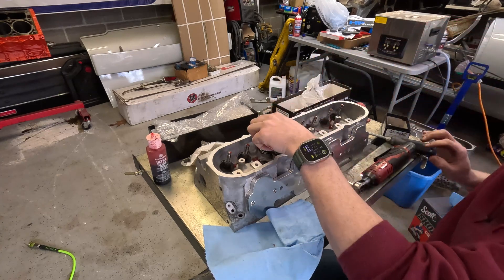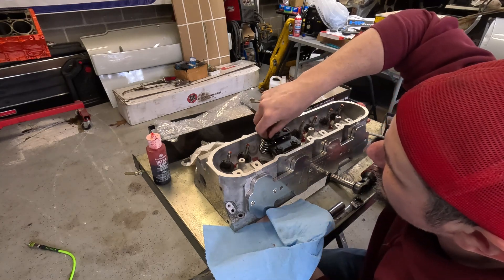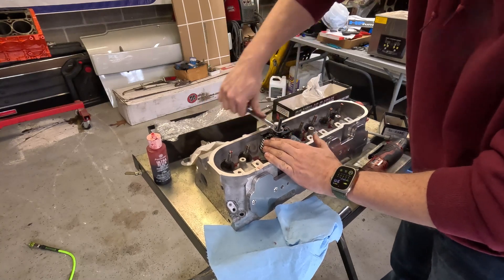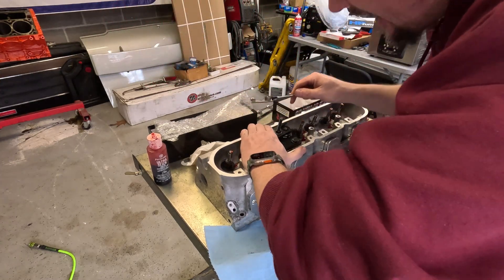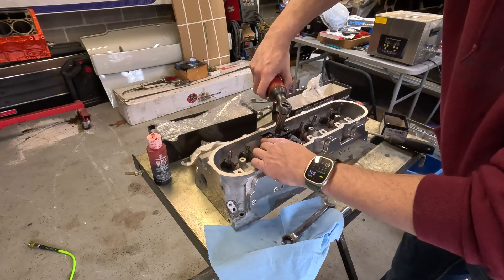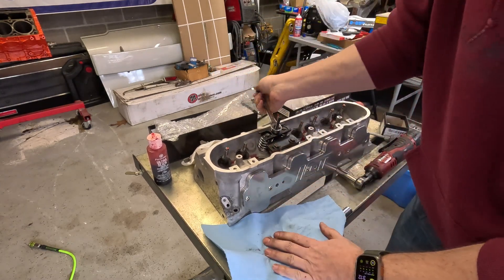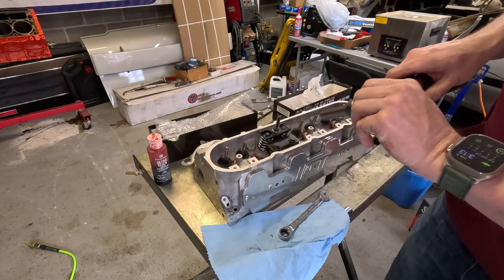The retainers — this is such a fiddly process. It's not that it's hard, it just takes time. A lot of times I'll back these things off by hand because if you're going too fast and one of these retainers doesn't fit down in the channel, you can shoot it halfway across the shop and never find it again. See, that one would have done it right there — that retainer is not down in the groove. Okay, I think both of them are getting started. They're both down in the seats — going to go ahead and zip this thing off.